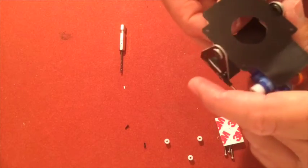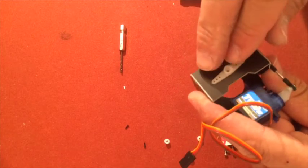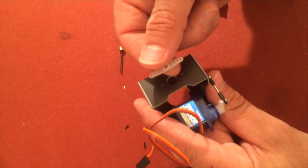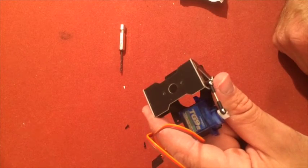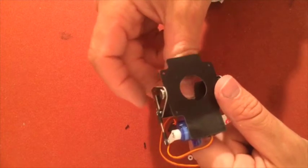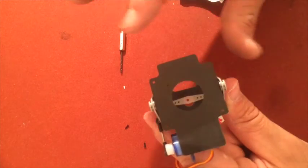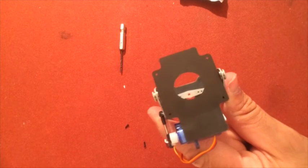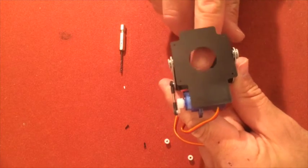And now here's an important part. Do not put the servo arm on the underside like this, because if the glue comes loose, then you will lose your camera, and or you won't see where you are going, and if you are far away, this is disaster. So put it on the inside here, because even if it gets unglued, then the camera will just stay approximately in the same direction, maybe tilt a little bit on one side or the other, but you will still be seeing where you were going, and you possibly will not lose your camera.